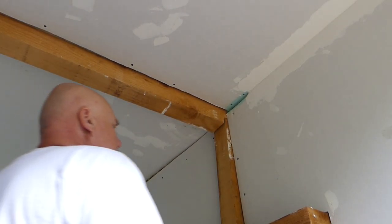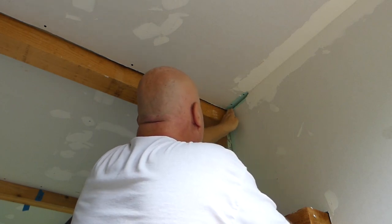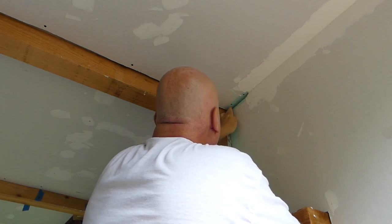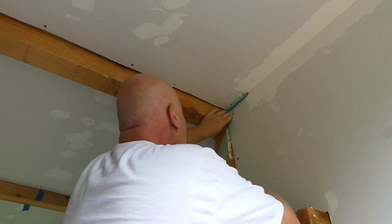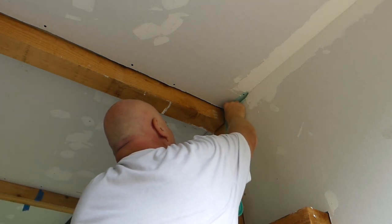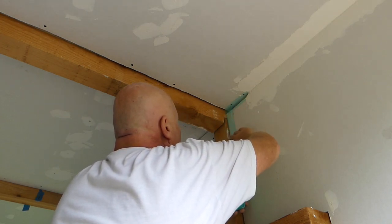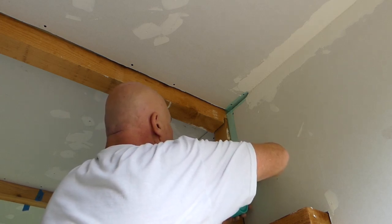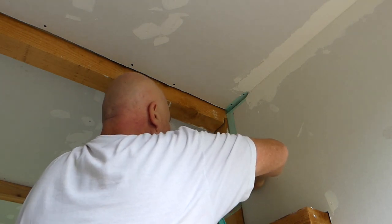As I tape, I do a final inspection of the drywall. So I had a drill and screws and things that I'm stepping on here. Now, in the corners with drywall to drywall, I fold the tape. You see how it's folded right there? But on these edges where I'm going up against the post, I just ride it along and kind of scrunch it. If there's one piece of fiber sticking out from the edge of the tape, I squish that in there where it's just touching. And this seems to be working for me.